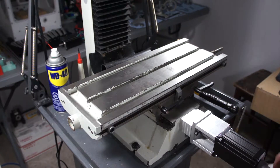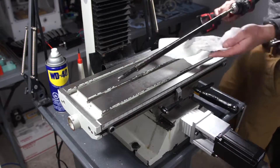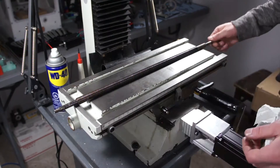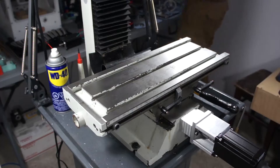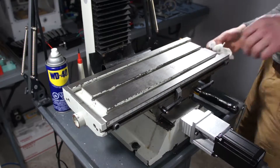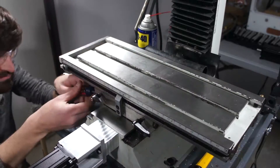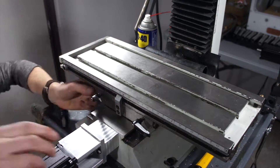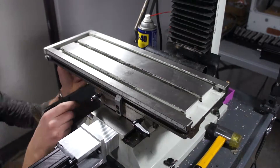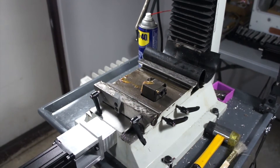It's quite a few turns — a tiresome thing to do by hand — so we used a drill to remove the lead screw. I was also pretty careful not to bang the lead screw around; that's basically the precision of the mill so you don't want to be dropping it on the floor. I almost decided to just pull the table off but thought better of it. The gibs are still tight and adjusted, and pulling it off like that could have caused some damage, so I just loosened off the gibs to make the table move a lot easier and give me more room for oopsies. With that adjusted, it slipped off just nicely.